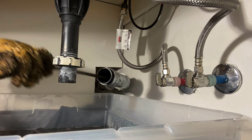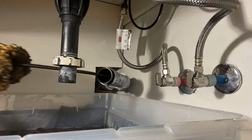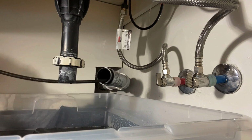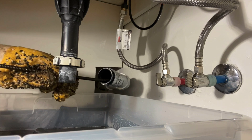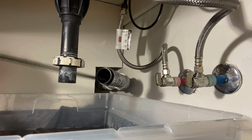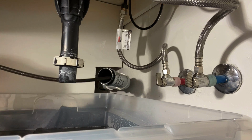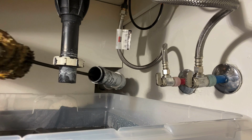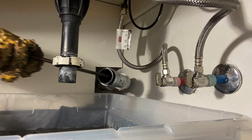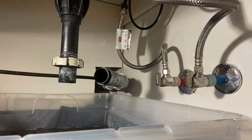One thing I hadn't thought about until filming this video, and this may be funny if you had already thought about this, let me know down in the comments. With these Jack and Jill side-by-side sinks, you could probably stick your mini camera down one side. You pull both traps, you stick your mini camera in one side and your snake or flex shaft, whatever you're using, in the other side, and being able to see where the drop is, you can focus on that area and get it to drop with very little effort.